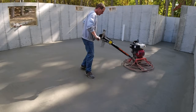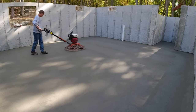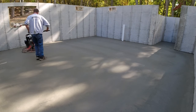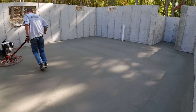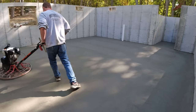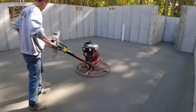You can see on the right-hand side it's changing color, getting a little darker — shining out really nice. This is basically the final stage of finishing. I'm not even really leaving footprints anymore; the concrete surface is really smooth. The next thing after this is sawing some joints in it with my early entry green-cutting saw. I'll show you the setup, the chalk lines, and what the saw looks like.